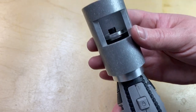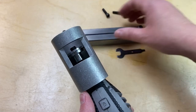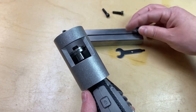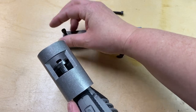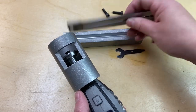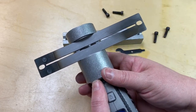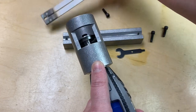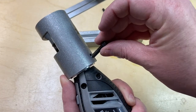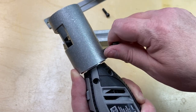Slide the coil cutter guard over the bushing and tighten with the set screws. To ensure the blade is centered in the coil holder base slot, remove the top from the coil holder base and place the blade and guide shield over the base. The blade should be centered and have equal clearance on either side of the blade. Use the set screws to lock the guard into place.